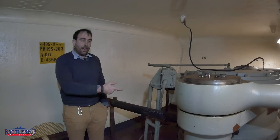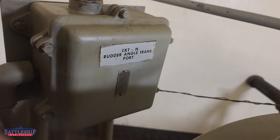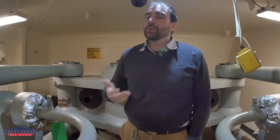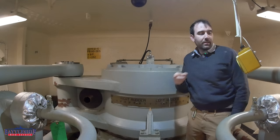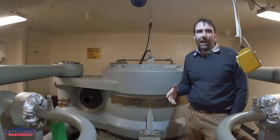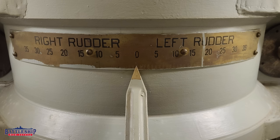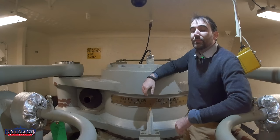So if we're not going to move with our own rudder, and our own rudder cannot move and is wedged in place, are we going to find that the rudder is at an angle? The rudder angle transmitter — which is that box over there — needs electrical power to work. Whatever circuit powers that is not on, so it is not transmitting the rudder angle to the various repeaters around the ship, particularly at the various steering stations. So how do we know what angle the rudder is at? The analog way. Notice that this backup is so critical they even have a battle lantern here pointing at it, so if the ship loses power and we're still able to maneuver, the guys down here can actually see what the rudder angle is. As you can see, our rudder angle is currently at zero.